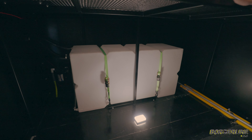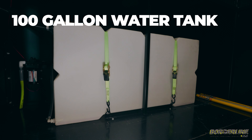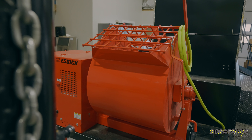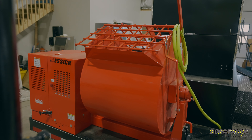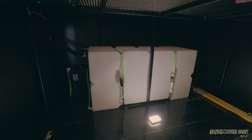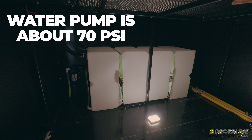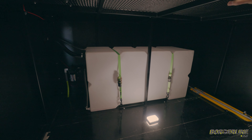This whole trailer here has what we call our water and power package — the most efficient as possible. You're going to carry your sand, your water, and your Portland all on the trailer. On the roof, we have a 100-watt solar panel with a solar controller right here. This is going to tell you your output, how much power you're using right now — we're at about 92% — and how much power you're creating from sunlight. There's all sorts of things you can adjust on there. We have an 800-watt inverter so we can plug in and charge batteries. We have lights in here too — early in the morning in summer when it's really dark, using your cell phone light is not ideal, so lights in here make it really simple. You're going to have a deep cycle lithium battery in here that powers everything, with a main on and off switch.